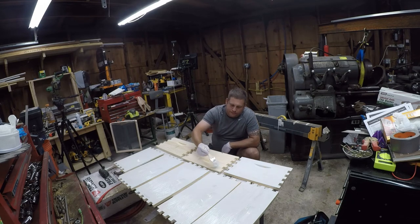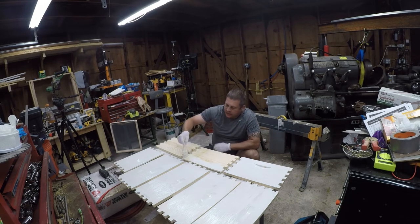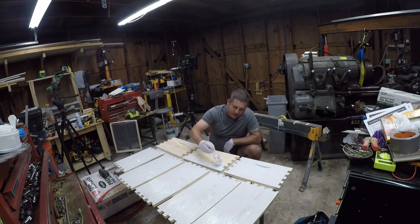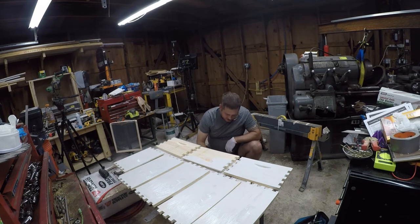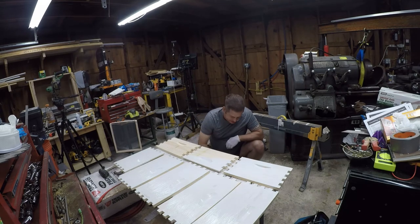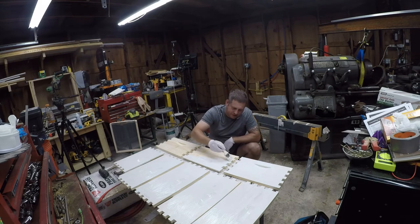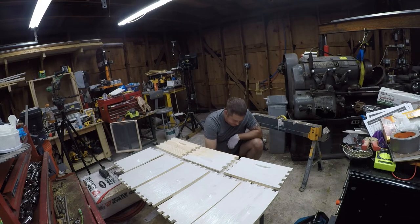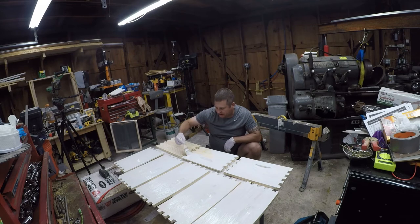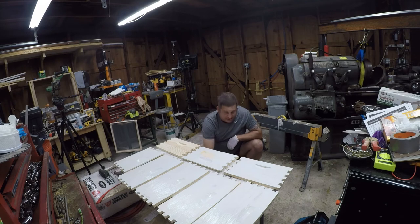And after that, I said, if I'm not painting hardy plank, and I'm not real concerned with color fastness, then I'm going to buy less expensive paint and be done with it. Because the color fastness and the chalking doesn't start until about 3 or 4 years. And by that point on wood, you got to repaint anyway. So I rest my case. Now I'm sure there's somebody out there using Martha Stewart's hand-picked fairy mixed goddess blessed paint, but it ain't me.